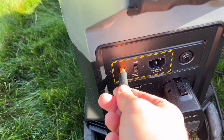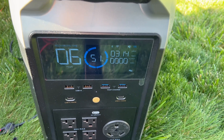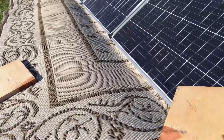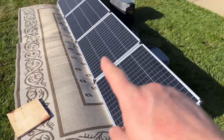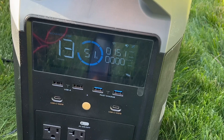We'll go ahead and plug this in. Now you can see we're getting about 315 watts out of all four solar panels. We'll start our testing by shading just a little portion of one solar panel. All four of these are connected in series, so remember our watts were about 315 watts.